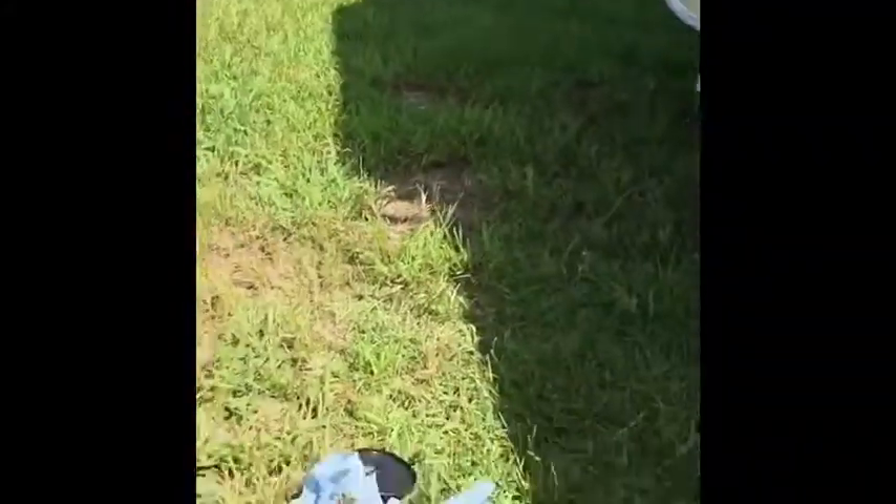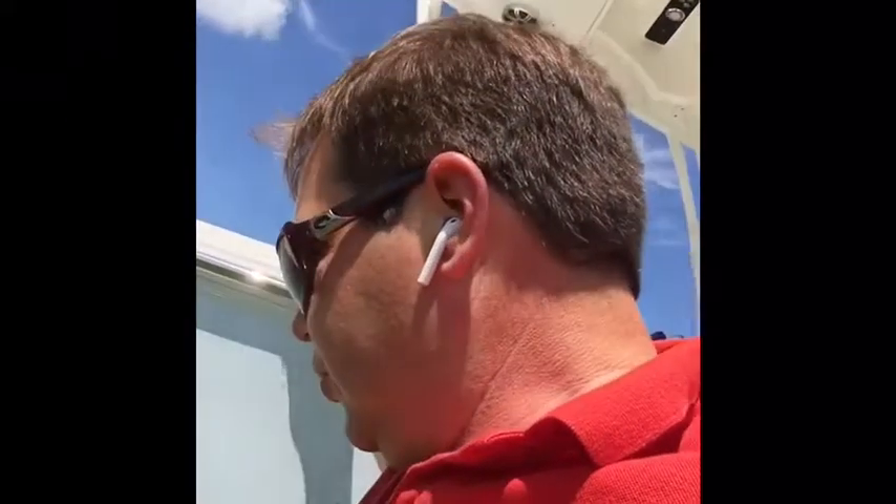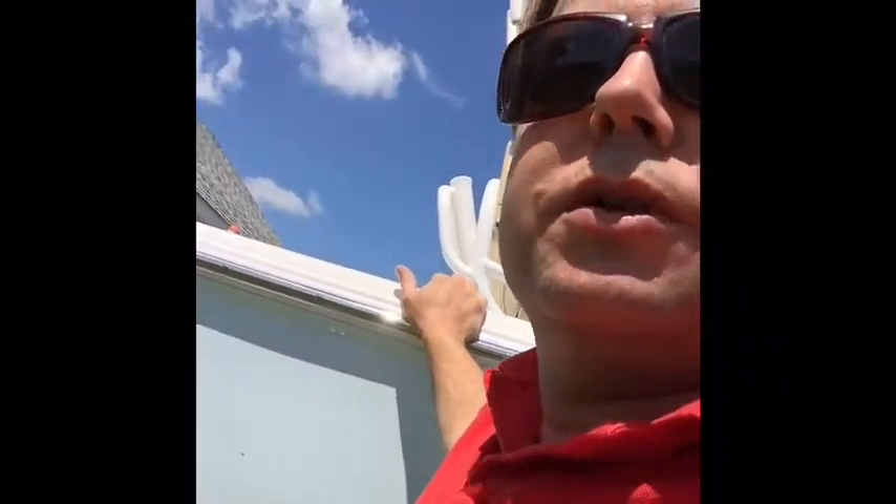I'm just using a multiplex grease — Supertech — since I'm going through it. You're greasing it every time you go out, so you're pumping fresh grease in. I don't really try to get the highest dollar brand because you're running so much through it. I just got the farm brand because it's what we use on a lot of our equipment. It's lithium-based, so I know it's got a better texture than some other brands I've used.